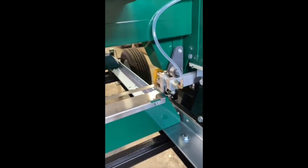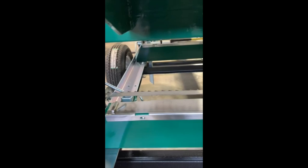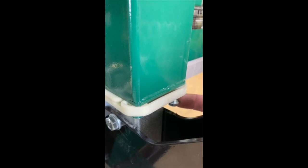And so I'll take a tape measure, measure off of the bunk to the center of the blade on both sides, and I want it exact. There's also an adjustment for your bare minimum, and that's this bolt right here. So the minimum's supposed to be 1 inch on these. You could probably go just a shade less if you wanted. But you adjust this bolt down so it lands down here.